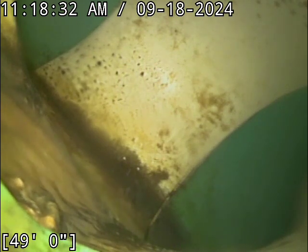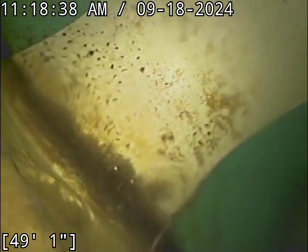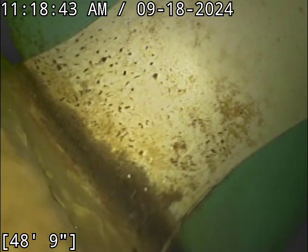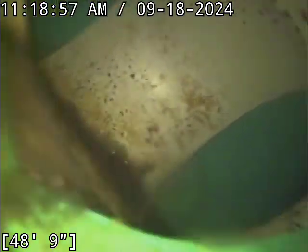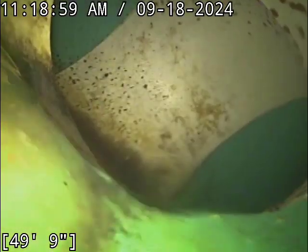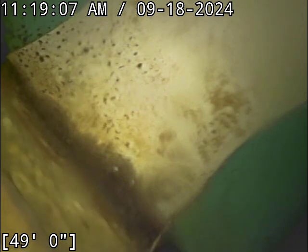A lot of times those transition joint bellies like that are often really not worth messing with, but we'll take a look, make sure the joints are sealed up, and we'll see how significant it is. I don't ever like to gauge or look at a belly until the line's drained out, because the running water does exaggerate things to an extent. But the plus side there is you've got a good hard vertical drop prior to it, which keeps things moving along pretty good, and in the event a blockage does occur, it creates quite a lot of head pressure, which is the water weight that builds up behind a blockage. So these are locations where it's usually pretty uncommon to actually get a blockage unless the line's being abused, but we will take a second look at that on the way out.